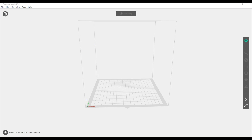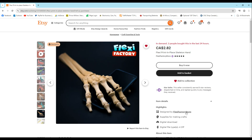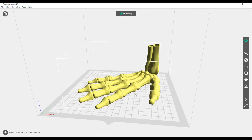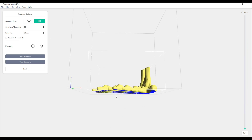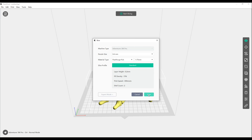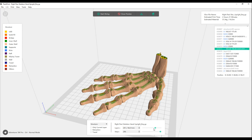Unfortunately I don't have Wi-Fi in my workshop yet, so I can't show those features in this video. With the software set up, I downloaded a print-in-place articulated 3D model from an Etsy seller called Flexi Factory Store — I've put a link to their store in the video description. After importing the model to FlashPrint it can be moved around the build plate, rotated, scaled up or down, cut, duplicated, and supports can be added if necessary. After slicing, the estimated print time and filament usage are displayed — around two and a half hours and 60 grams of filament in this case. The layer preview slider lets you inspect the model before sending the G-code to the printer or exporting it to a USB drive for offline printing.